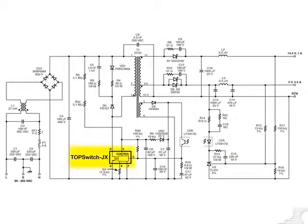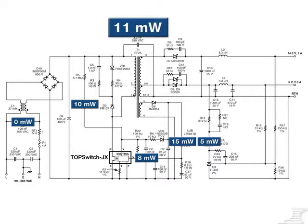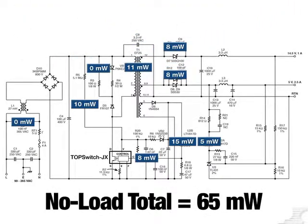The unique no-load and standby performance in TopSwitch JX designs is made possible by several integrated features. Jitter lets you design with a smaller X capacitor that doesn't require discharge resistors, completely eliminating those lossy components. TopSwitch JX also dramatically decreases control pin current, minimizing controller consumption down to just 8 milliwatts. This reduced current also lowers both primary and secondary feedback losses. Line detection consumption is reduced, and by using TopSwitch JX's multi-cycle modulation mode to maintain output voltages at light loads, transformer and output diode snubber losses are substantially reduced.